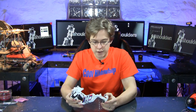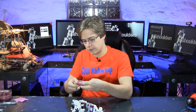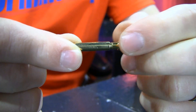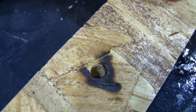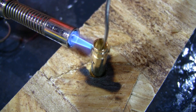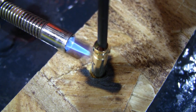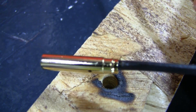So now, how do we connect these wires to our electronics and to the battery? We're going to be using two types of connectors. The first is a bullet connector — it gets its name from its shape. Bullet connectors are used in most LiPo batteries, and this is how they mate, male and female. To connect these to our wire, we grab a piece of wood with a hole drilled in it, put the connector in it — we do this because the connector is about to get really hot. We touch a butane torch to it, or you can hold a soldering iron to it, get it hot, put in some solder in the bucket, dip the wire in, let it cool for at least 10 seconds to make sure the solder is strong, and you're done.